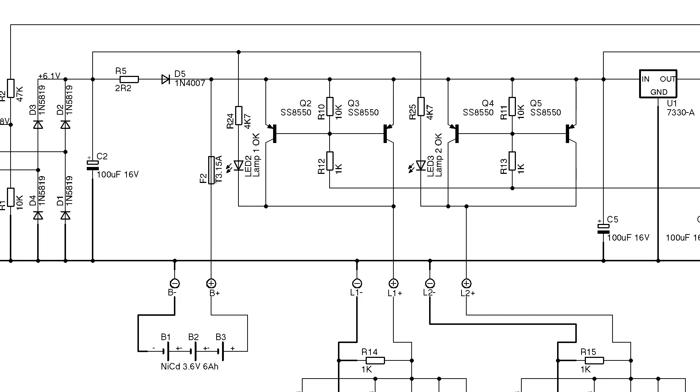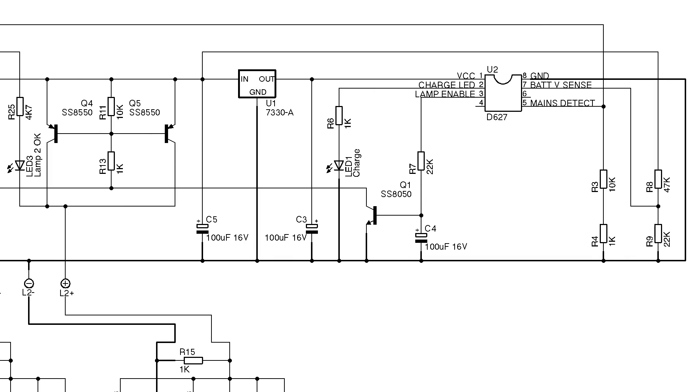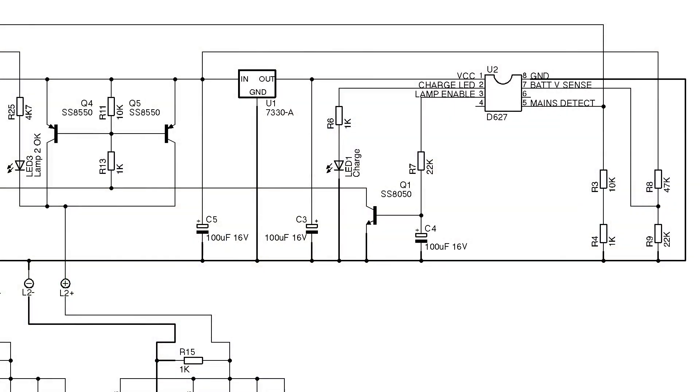Those PNP transistors are all turned on by pulling their base voltage down, which is the job of NPN transistor Q1, and that gets turned on with a soft start thanks to capacitor C4, controlled by the microcontroller. The microcontroller's job is pretty simple: the charge light is on unless the battery voltage goes too high — indicating it's no longer charging while disconnected — or the mains has failed. The lamp control turns on if the mains has failed and the battery voltage is high enough. If it's gone off because the battery is low, it stays off and won't turn on again until the mains has been restored at least once. This could be done with comparators and logic, but given how cheap 8-pin microcontrollers are, plus the flexibility of coding in turn-off/turn-on delays, initial boot-up action, and preventing pulsing when the battery is low, it makes sense to just do it this way. The microcontroller gets powered from a 3-volt regulator.